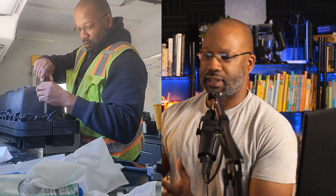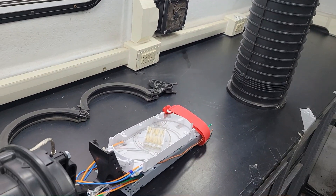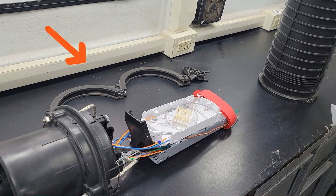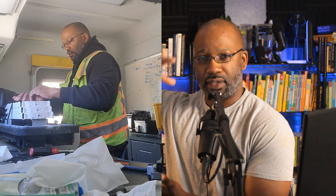It's able to accommodate 1,728 fibers — those would be bare fibers — and it really depends on whether it's ribbon splice or single splice. One of the standout features outside of the large capacity is the locking mechanism. A lot of the enclosures shown so far are in two pieces secured by a large C-clamp or bracket. In this particular case, we have over-center latches that secure the top of the enclosure to the base.